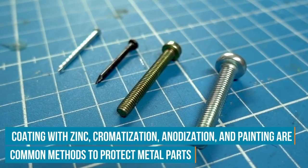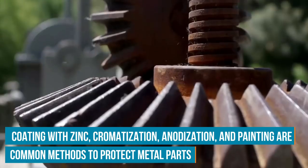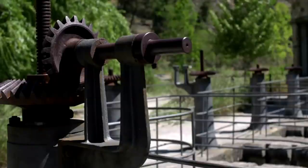All the commonly used metal parts have to be protected from the environment, because little blank screws can turn into a lot of rusty stuff very quickly when exposed to the environment. So what the factories do is coat these metal parts with other metals that make them more resistant — and that's usually done with galvanizing or electroplating, which is just putting a tiny amount of metal onto another metal to give it a protective coating.